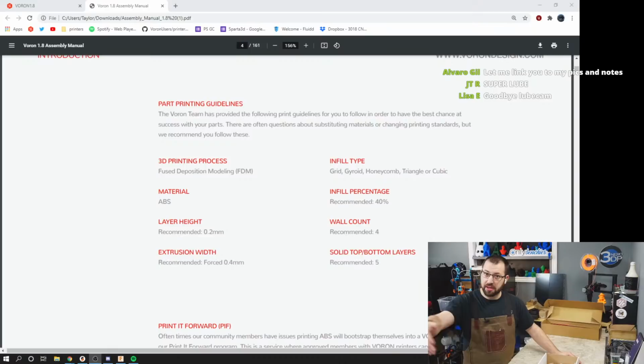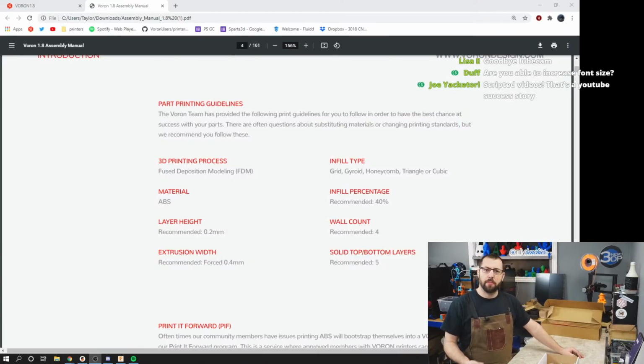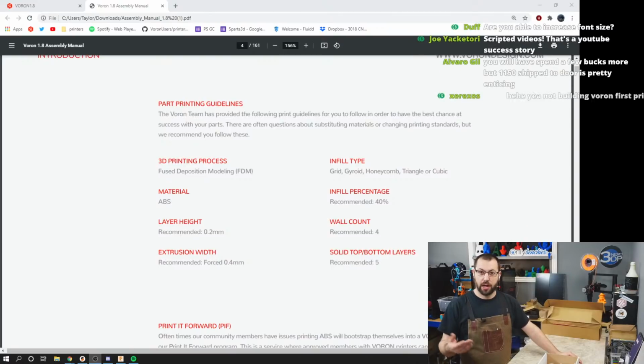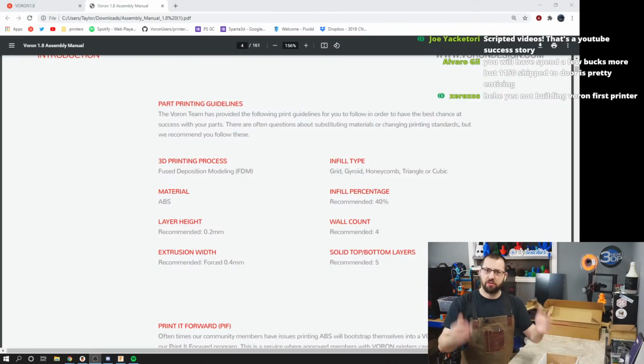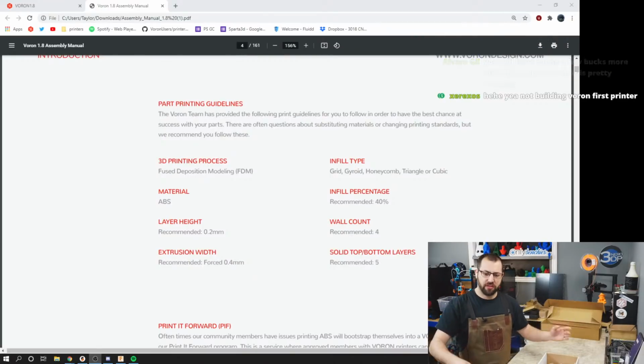There are other plastics like the nylons and the polycarbonates. We're doing more testing on those. This guy's going to be CF nylon, for example. Polycarbonates, a lot of them have issues when exposed to grease and oils where they actually break down and crack. And it gets in between the layer lines. It causes delamination and whatnot. So ABS is just, we know it works. It works for pretty much everyone. That's why we recommend it. It's got the highest chance of success.